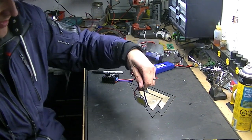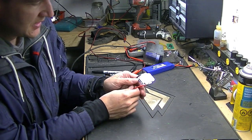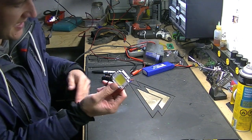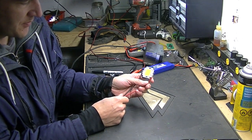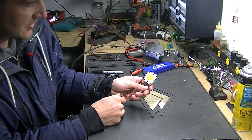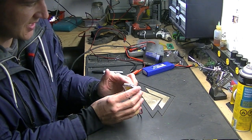It is a 100 watt LED. When I say 100 watt, I don't mean equivalent to a 100 watt light bulb — I mean it actually pulls 100 watts of power. These LEDs, you can get them on eBay pretty cheap. They're about 10 bucks, but they need about 35 volts at over 3 amps to power them. So they really suck the juice back, and also they generate a lot of heat.